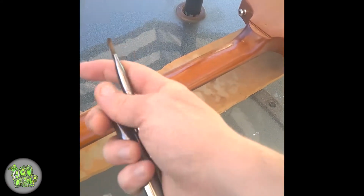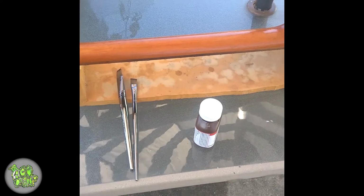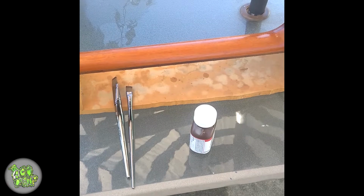Okay, so I've now wet sanded the entire back part of the neck. That's set up. This part's been wet sanded, along with that little pocket in the front. And I have 2 more synthetic brushes. Again, use cheap brushes because this stuff is going to destroy them. Odds are, by the time I'm done with this process, I'll destroy both of those brushes, and I'll need to get 2 more, maybe 3 more, to do the neck on the Flying V. And then after that, we'll proceed to doing the other guitar.